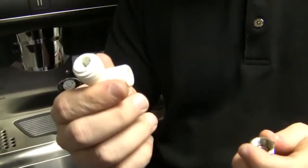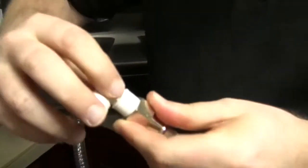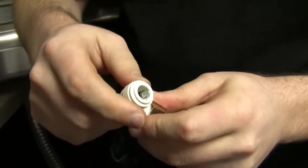In America, the easiest way to deal with this problem is a little plastic piece called John Guest Fittings or Quick Connect. These actually screw into both American and British pipe threading at three-eighths. So effectively it's just going to screw in just like that. Once this happens, it takes it to a manageable product we can deal with in America — it'll hook into the rest of the plumbing, which we'll get to later. So the first thing is just converting this into something we can deal with in America.